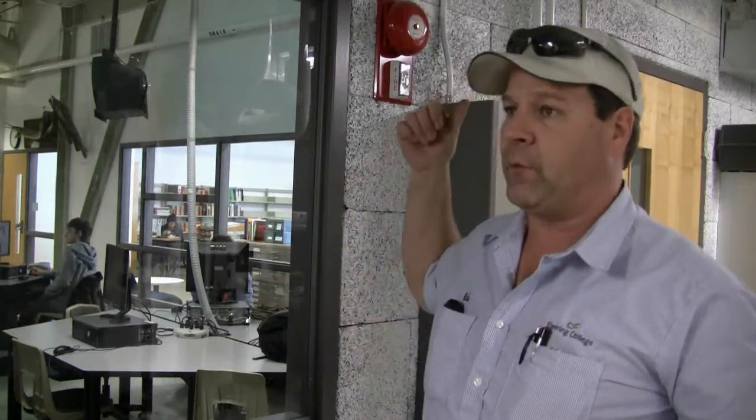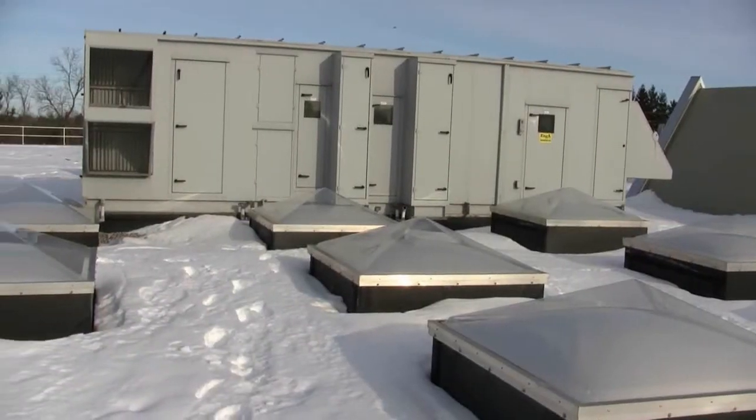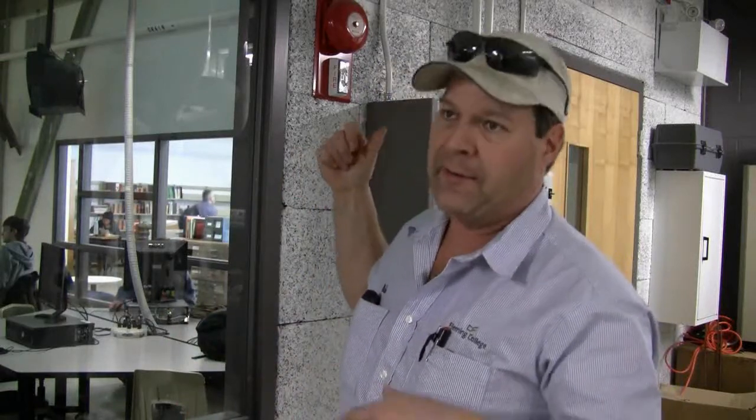What we put on the roof — if you look on the far end up by the green roof, you'll see a big gray unit — is a heat recovery unit. The air that we are exhausting transfers its heat to the fresh air coming in by means of a heat wheel. That's one of only three units in Canada that's as efficient as it is at transferring temperature. Even on a really cold day, we still need to do a little bit of preheating of that air before we dump it into the space, and we do that by taking the heat we reject and putting it into hot water to preheat the incoming air.